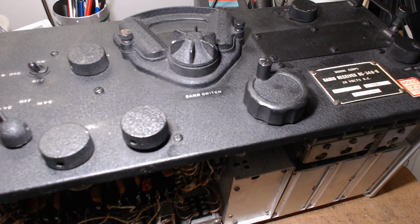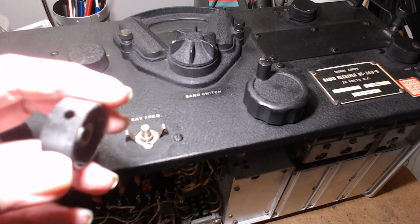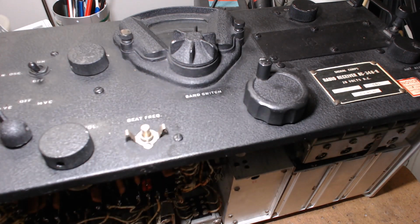See, if you use heat dry, what happens is the set screw might move a little bit and then get trapped even worse. So you have to use a combination of penetrating oil and heat in some worst cases. In the real bad cases, I showed you one time, I took a slitting tool, put it on a Dremel, and cut the knob off. But what I want to show you is that some of the knobs have 2 set screws, and some of them don't.